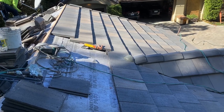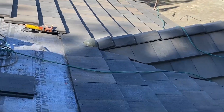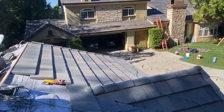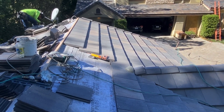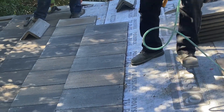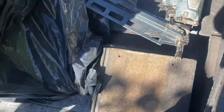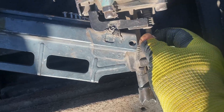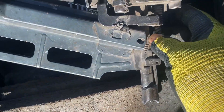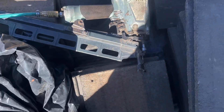We nailed the tile with nail guns. I think it's easier — it makes the installation faster and you don't break as many tiles. When you nail by hand, sometimes the hole from the factory isn't well done, so you bust the tile. When you use a nail gun it's so fast that the nail itself makes a clean hole in the tile. This is how I adjust the depth on the nail gun — it has the adapter for the nail depth.